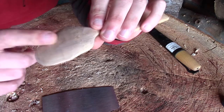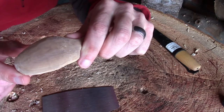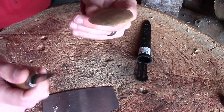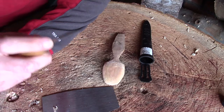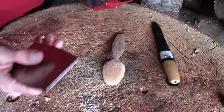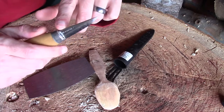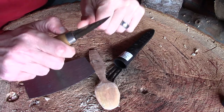There'll be a lot of people who argue you can do this with your knife, and you absolutely can — lots of very small cuts. Alternatively, if you've got a knife like this, the back of the spine is not quite as square as my cabinet scraper, but a few minutes with a file on the back of the knife and you can get a nice square edge to do exactly that. I prefer using a purpose-made cabinet scraper since I have them to hand. Also, because this spine has had the corner slightly knocked off, when you're pushing with the back of your thumb it's a lot more comfortable.